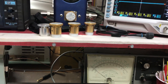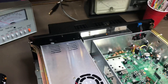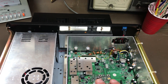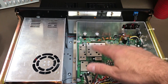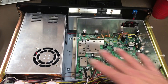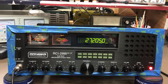So if you're looking for a radio that was just gone over — you can see the switch on the back for the high-low. What else was done to this radio? If you look in the pictures, they designed this radio decently — they did a good job separating the units. But what they didn't do a good job was protecting the circuit board and the components inside. The only thing they protect is the power supply with the big fuse on the back. So we installed a fuse protecting all of this circuitry on the bottom side — a second internal fuse for protection, which is a huge deal. It's something they should have done from the beginning. It's a couple bucks, but here you go.